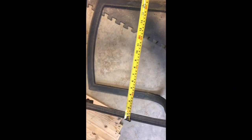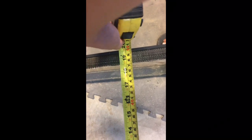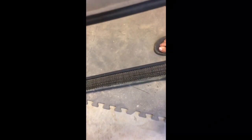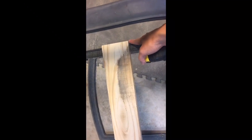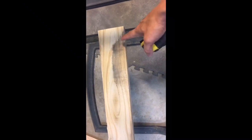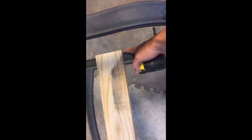The first thing you want to do is measure the width of your chair so you can cut your boards the right width. This particular chair is just under 20 inches. I like to give a little overlap, so I'm going to make my boards just over 20 inches — like 20 inches and a quarter. That gives a nice little overlap on either side, which is what we want. Otherwise, when we drill those screws into the wood, it's going to split the wood. So you do need that little bit of overlap.